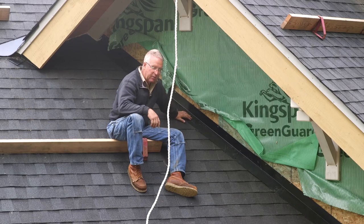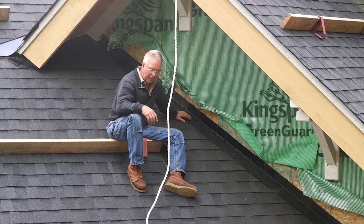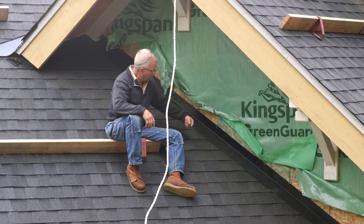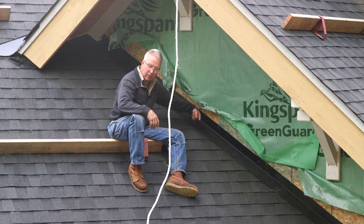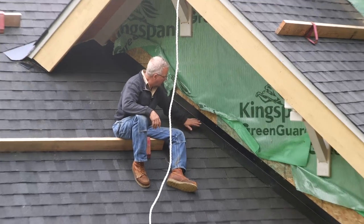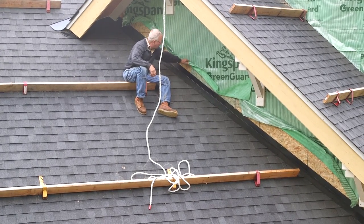This piece of flashing is a little unique. It doesn't happen like this very often. What we have here is a gable dying into a gable end at an angle, which means that we do not have step flashing that's running parallel to the pitch, creating a gutter. We have sidewall flashing against a wall that is fading away, because watch this.